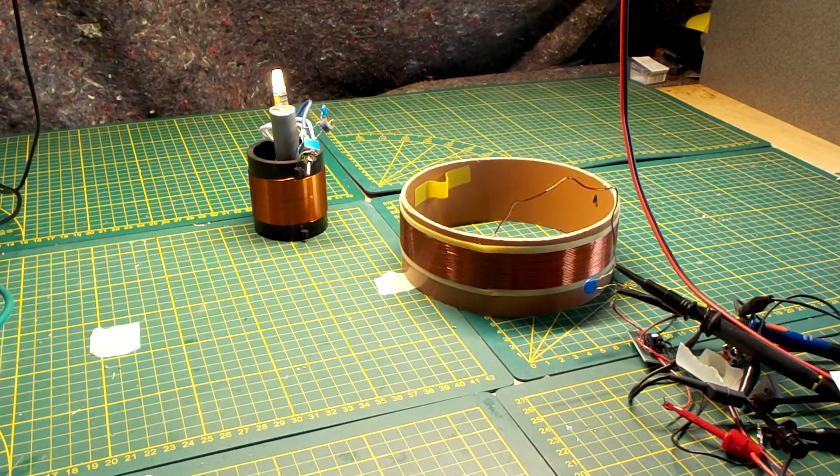What we are seeing over here is our receiver coil tuned to the frequency of our transmitter. There is a difference between series and parallel: when we use series, as it is switched now, we can come closer to the transmitter coil but we don't create a phase shift. We will see that the amplitude goes down on our transmitter but there is no phase shift.